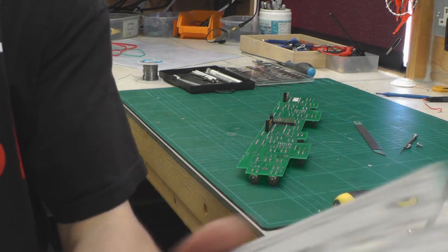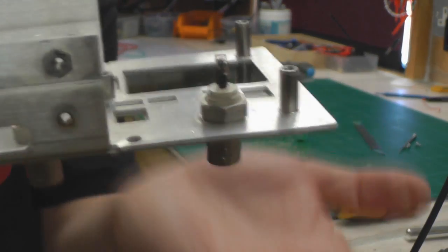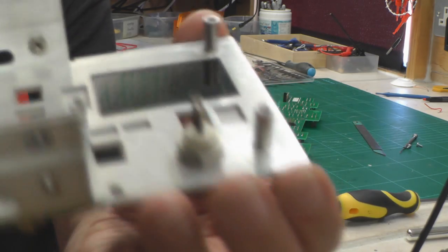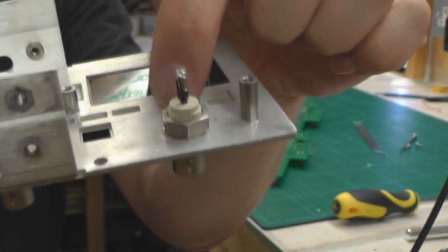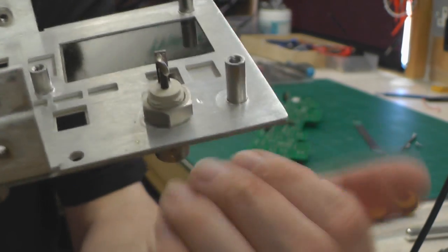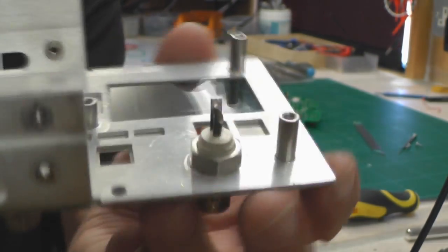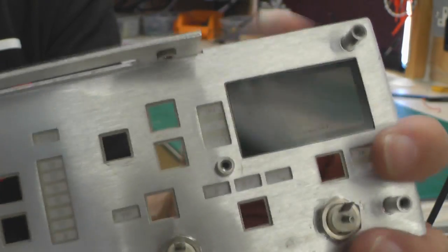The bezel itself took a bit of a hit on one of the BNCs at this end. What I actually did was I laid it flat on the workbench with a couple of aluminium plates top and bottom - I took off the BNC connector and basically sandwiched it between two plates of metal and hammered it until it was completely flat. Just a word of warning to anyone who thinks they want to do the same thing - the last thing you should be doing is applying a hammer directly onto the metalwork of the piece you're trying to straighten - it's just going to leave marks and indentations. You put a bit of metal underneath, a bit of metal on top, and then you hammer it that way. I've more or less got it as flat as it needs to be, and I've also straightened up the pillars.